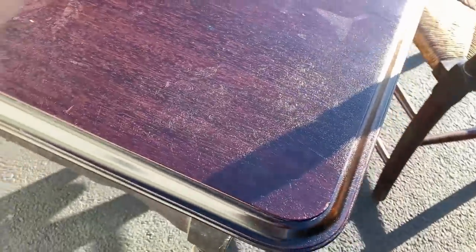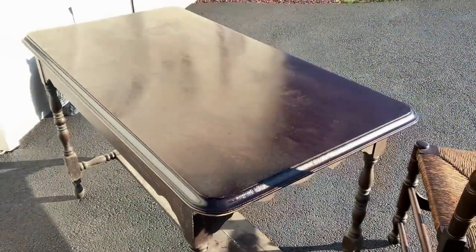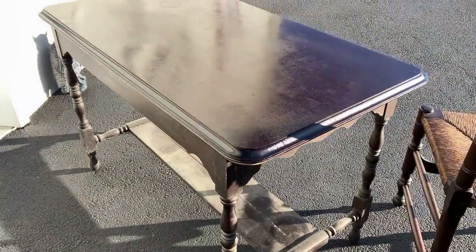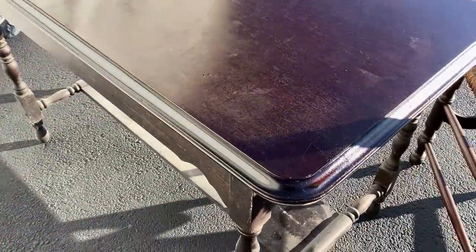I'm going to be using this as a desk for myself. The top hasn't dried yet, and when it dries I will buff it to de-gloss it a little bit to get it down to a satin finish. But what I like is all the old original alligatoring of the old shellac. That's 100 years of good old hot South Jersey summers and freezing cold winters that give you that look.